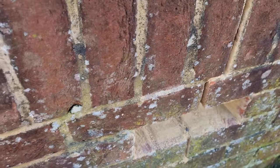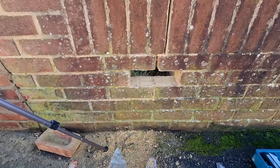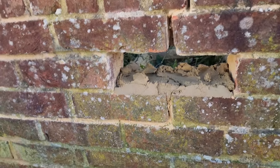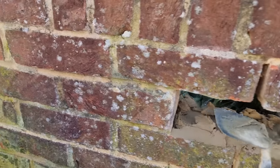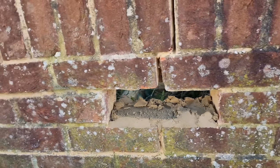I've noticed the sand's a lot lighter on this side. It's not white cement — it's lime mortar. I'm going to repair it with the muck I've got, but to get a better colour match I'm going to add a lot more sand. What they call the gameshow mix — 15 to 1 — that'll lighten it right up and give it more of that yellowy colour. The sand in London is really yellow, so that should bring it up to a nice yellow colour. By the time that's dried out it'll be quite sandy. I didn't put any less cement in because it won't stick, but it's definitely a little shade lighter so it won't stand out quite so much.